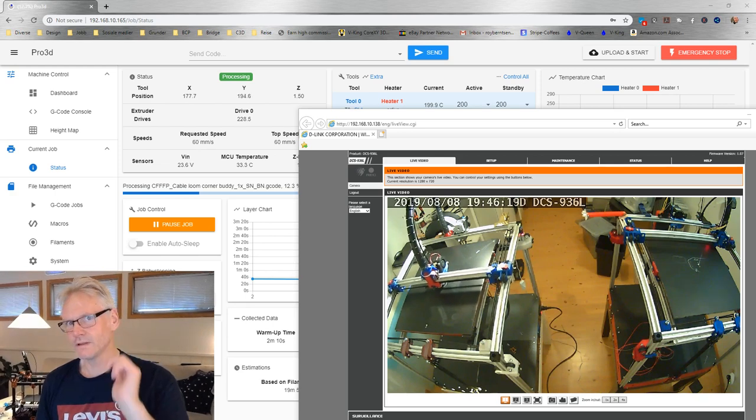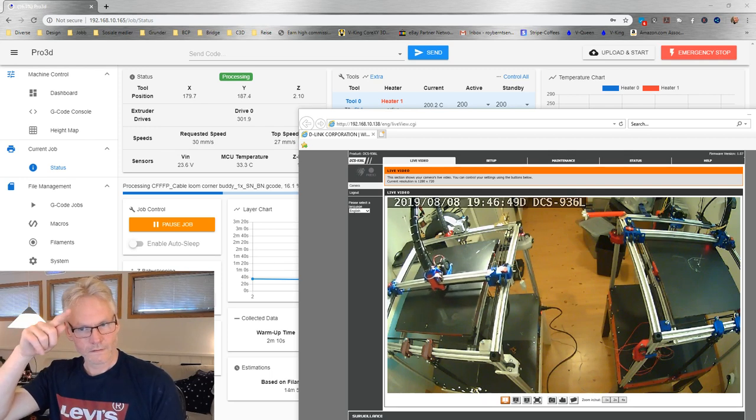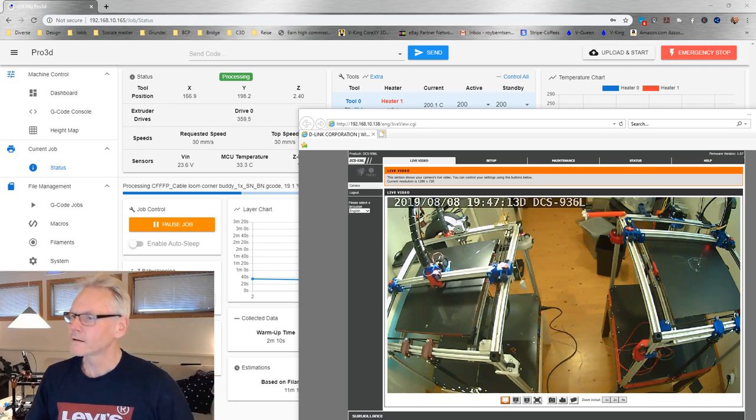Actually, fillets in 3D printing parts are not working the same as in, let's say, injection molded parts or in CNC machine parts. We don't see the same need. And also printed fillets in this way, I would call it vertically, they do not print well. So we'd rather use chamfers in the vertical direction rather than fillets, because fillets will be printed layer by layer like this, and that does not work very well.